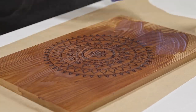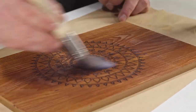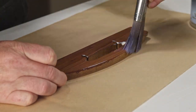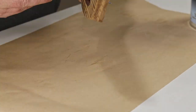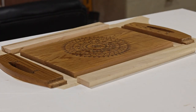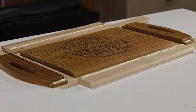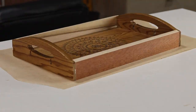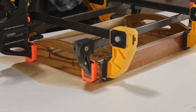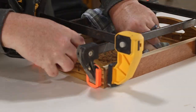So now I'll give it a little protection with some water-based varathane. The two ends will have some varathane as well, but not the sides since they already have their own finish. After a couple of coats, I let everything dry, and now it's ready to assemble. I was going to use glue with brad nails, but I didn't want to patch up all the nail holes. So I think glue alone should be strong enough for this nightstand tray, since a nightstand tray shouldn't be carrying a pitcher of lemonade out to guests on the patio or anything.